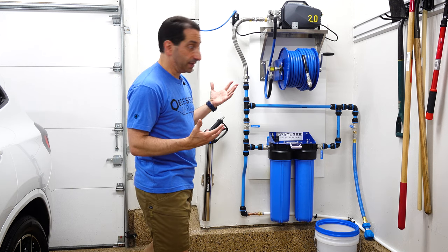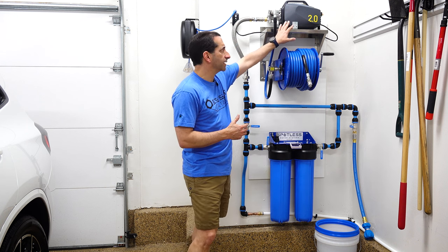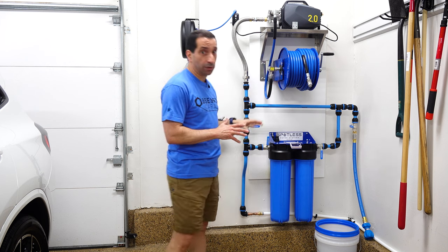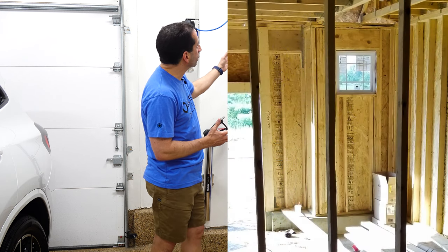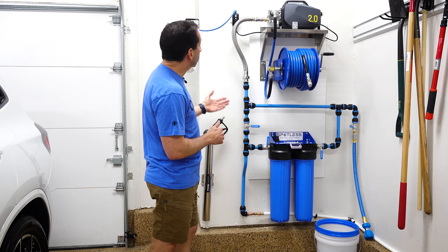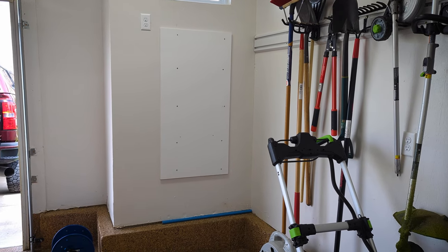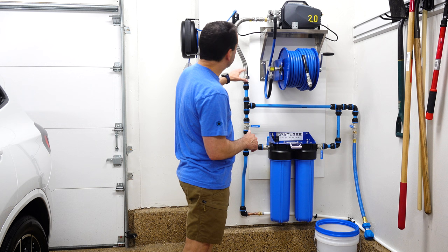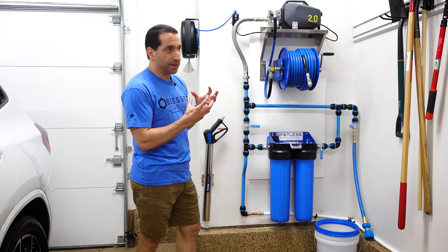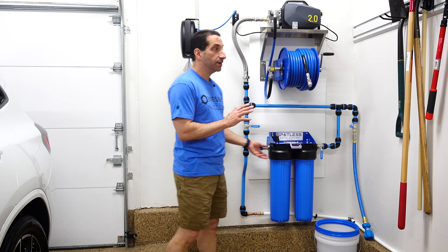I knew this stuff is heavy — and it is absolutely heavy: the CR Spotless, the Cox hose reel, the hose. The Active 2.0 and shelf are not heavy, but once you put water in things it gets heavier. I knew I couldn't hit all the studs with everything, especially the CR Spotless, so I got a two-by-four-foot, three-quarter-inch thick piece of birch plywood, painted it, and put about six screws on each side into the studs. Then we mounted everything into that, and it's been rock solid — no issues at all.